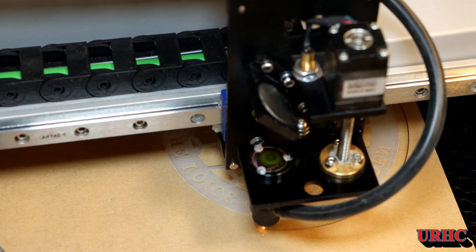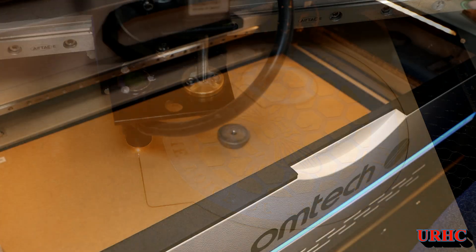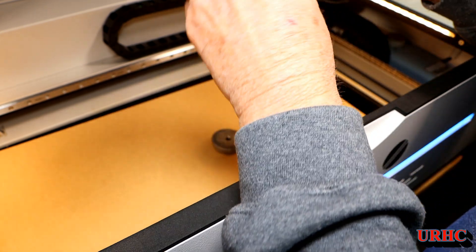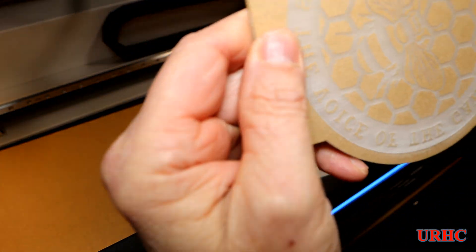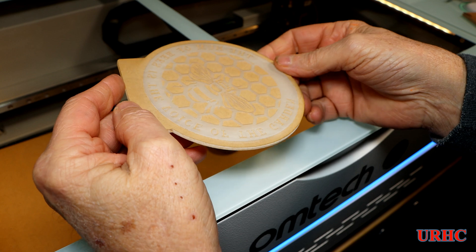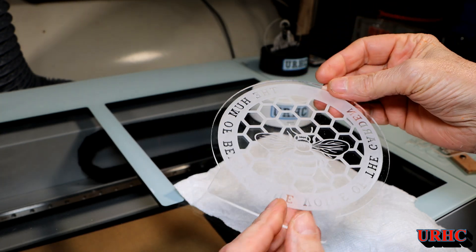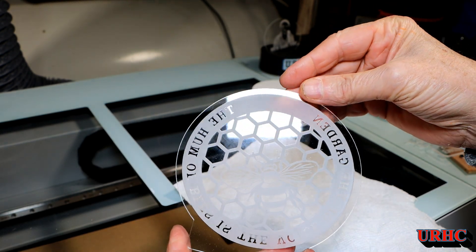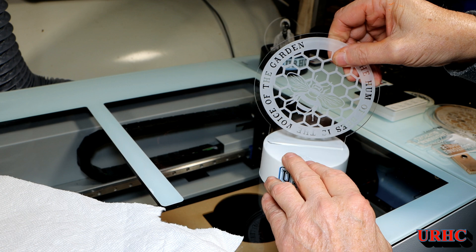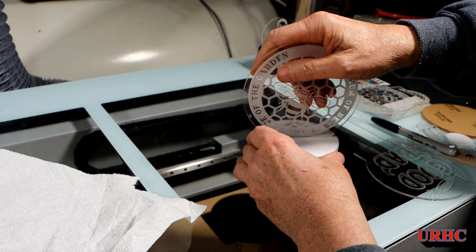It comes off the laser now, and I've been having really excellent luck with these lenses I switched over to — still running the same one with no problems. You can see a better idea of this one: how nice and sharp and deep the edges are, and how it was turned sideways so the lines all run up and down. The lines are close together but they look like a frosted finish, yet they transmit light better when you go vertical.